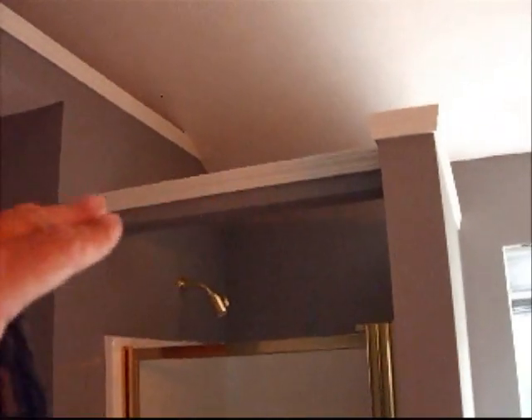The shower has this funky beam going across the top, and it's a full 8-foot wall over here. They don't want that anymore — they want a knee wall. Knee walls are usually 4-foot high, and your window usually wants to line up at the bottom of the windowsill with the knee wall. In this case, that's not going to happen — it's 3 feet from the floor to the windowsill. So we're going to make this knee wall 3-foot, which is a little low. They're going to put a panel of glass right here along with their new glass door, so it'll probably be a 4-foot panel to get up to 6, 6½ feet. That wall will be gone, and bringing it down to the 3-foot level, that beam will be gone too.